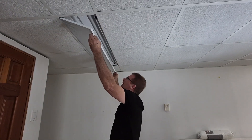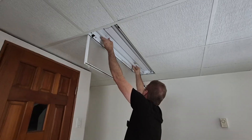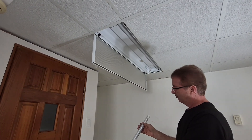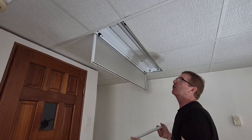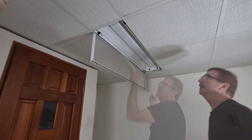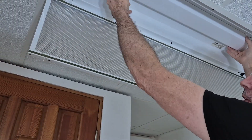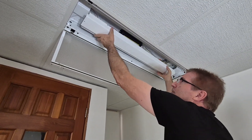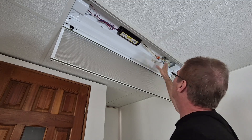These just open up here and they come down. So you take the bulbs out. Normally you wouldn't have an LED, but these are LEDs that require the ballast. I'm switching to an LED that doesn't require the ballast. Then I've got to take this off here — you just squeeze it together. On this particular model, they're all different. You squeeze it together where the clips are and then you pull it down. That's where your ballast is right here, so this is what's coming out.